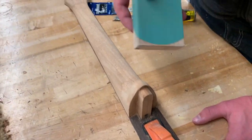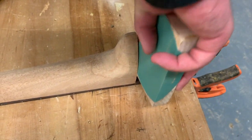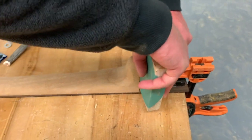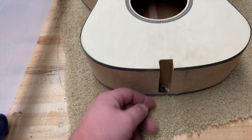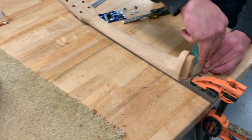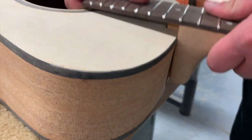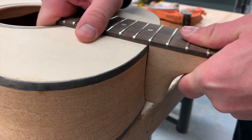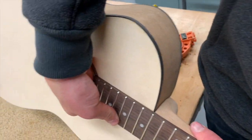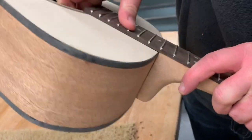After you've chiseled a little bit, you can take that same sanding block. You want to hold this at that angle — kind of an inner angle — and you can just do some fine-tuned sanding and shaping of this neck, trying to get that to match perfectly. So you can see where you've kind of flattened out a little bit with the sanding block, shaping that neck as well. We're going to check that again and see if this fits. We just want this to come together when you press it really tight so you don't have any gap anymore — that's going to hold a lot better. We're going to check both sides, make sure there's no gap. That's looking quite a bit better. It might need just a tiny bit more sanding, just trying to get that fit.